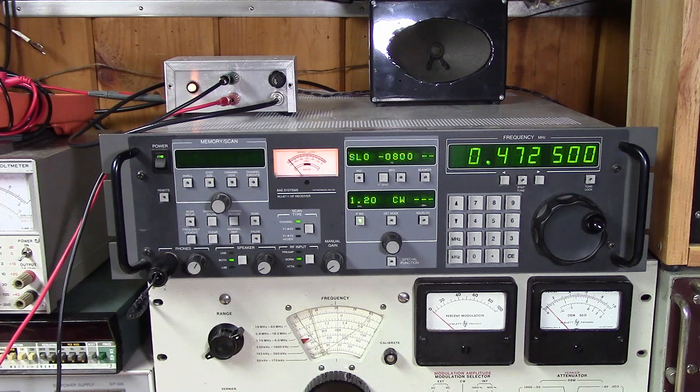If I was using this with a small loop, like a one-meter loop, I would probably go for the added two stages after the common base amplifier. But I think this is a successful and very stable amplifier — the common base push-pull loop amplifier.